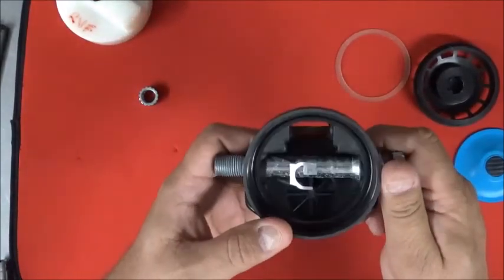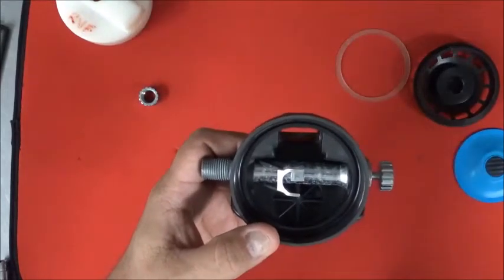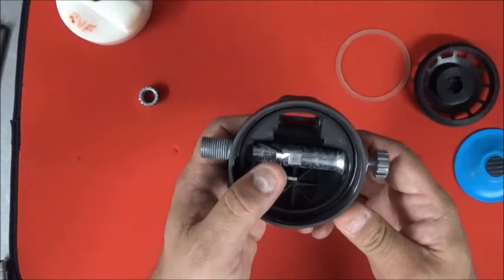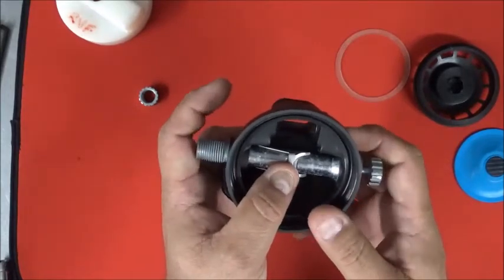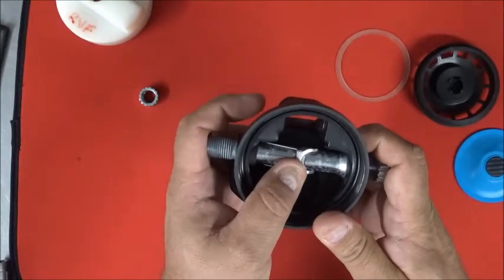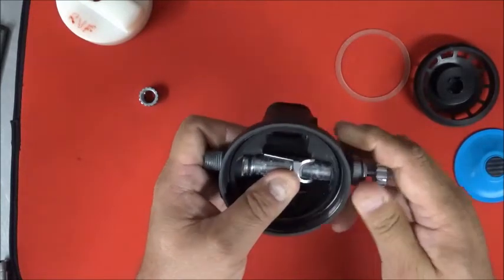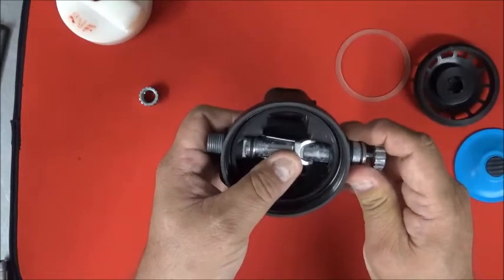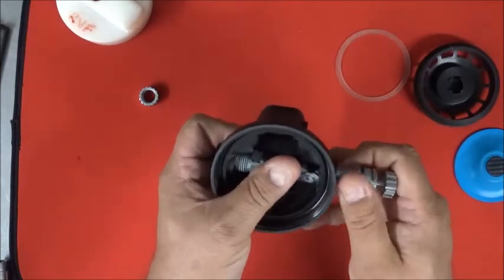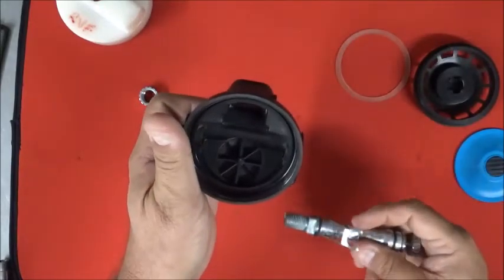One of the many cool things about the G250 is you can remove the whole air barrel, and it's a lot easier to work on when it's out of the regulator. Simply depress the lever with your thumb and push out from one side. When you get some movement, pass the square, turn it sideways, and the whole thing slips right out.